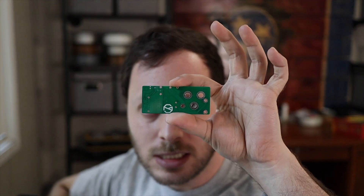I think the board is mostly ready. I'm going to kick off the circuit board design so we can start putting those into the 3D models. I'm going to try something new this time — normally when I do circuit boards I design the files and then place all parts by hand. This time there are a lot of things to place, especially if I'm doing more than one set. There's a company called JLCPCB that does cheap circuit boards and will put the parts down for you and send you the boards, so I may give them a go. One thing is they only have a select number of parts, so I have to use their parts instead of my usual ones.